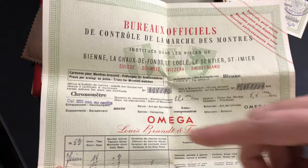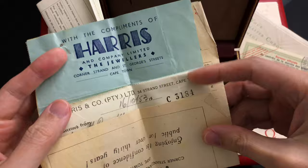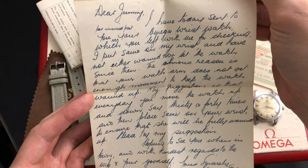Looking at the worn crystal, I can tell that this watch must have gone through a lot of wrist time and probably has not been serviced for a very long time. Shaking the watch, I can hear a cling cling noise inside coming from the automatic weight. This tells me that the automatic weight axle or jewels are broken inside. Let's put everything back into the box except for the watch and begin the restoration.